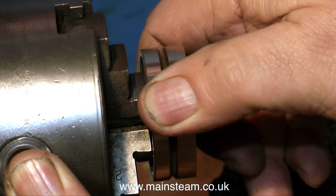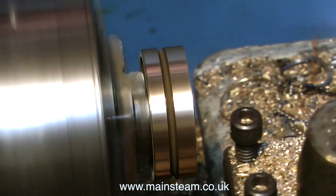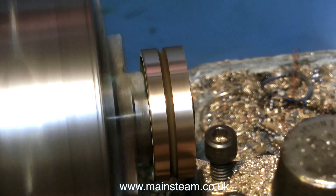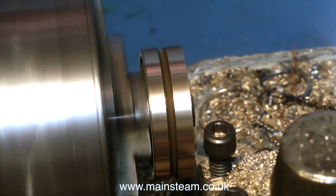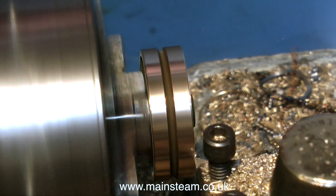Once I make sure it's firmly screwed onto the mandrel, all I have to do is machine the face of the pulley to be the same thickness as the part the other side of the centre groove. Once again, I'm taking very slight cuts. This pulley is not on a heavy-duty mandrel and it's not supported at the outer end, and it would be disastrous if it jumped out of the chuck at this stage and broke the tap being used as a mandrel.